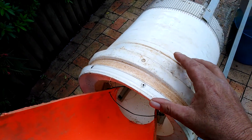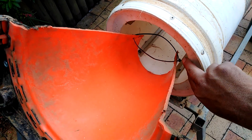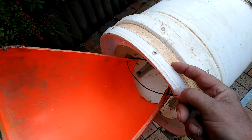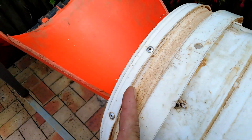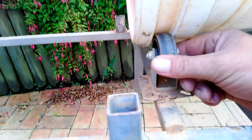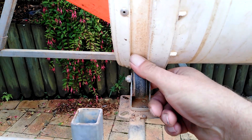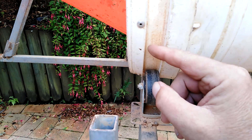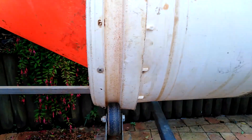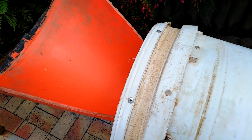You will need two drums because you need to cut the tops off — one longer than the other. On this end you need to have a lid with a hole cut out to feed material in, and it also acts as a buffing point. The ridge on the back is quite thick, which allows the caster wheels — straight casters from Bunnings — to fit inside the track and stop it from sliding off. The lid is pop riveted on, otherwise it will just pop off.